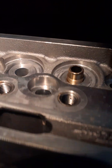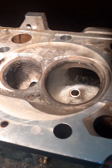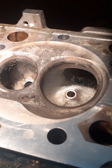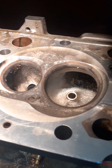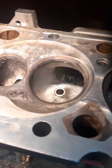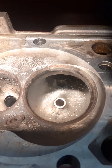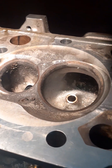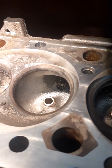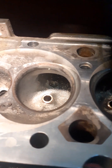We will cut the seats again - actually for the second time - because there was a problem with the air filter. I have already done the valve seats one time before; now I'm going to cut the valve seats for the second time. By doing this in this way, I know that the valve guide has a straight bore with the right clearance to the valve stem.